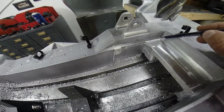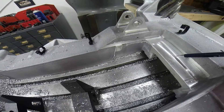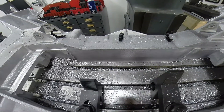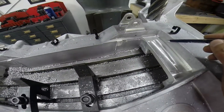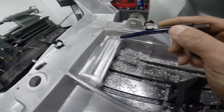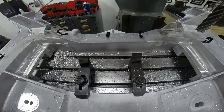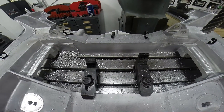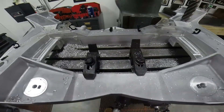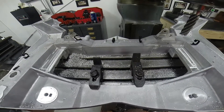I've got the same thing on the right side — square edges and the same height pad. Once I have that, I'm able to remove the material from the center of the casting and run an aluminum bar or flat plate from this side of the casting to this side of the casting, less the seven inches. That'll give me my exact seven inch dimension that I need and will also ensure that the casting remains square and the height of these pads remains exactly the same right before welding.